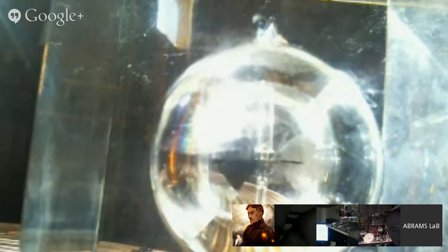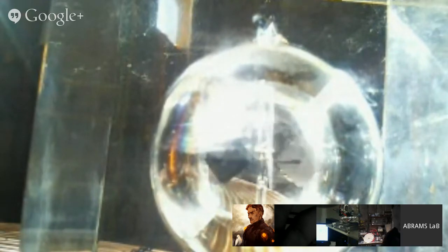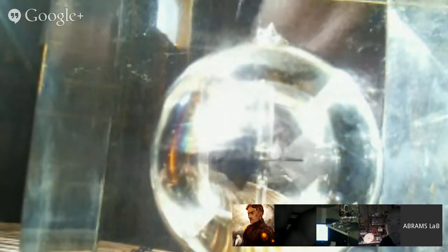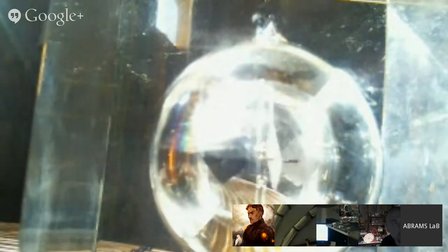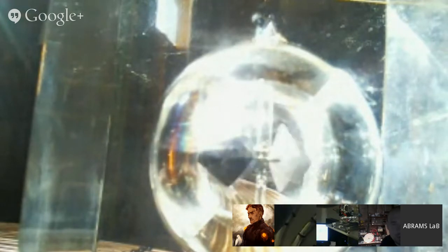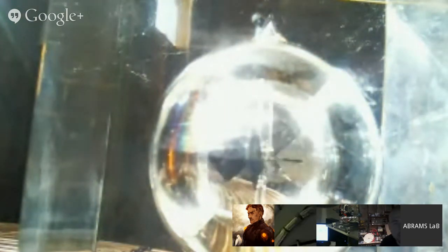Yeah, probably the best thing to use is helium, and it's not as dangerous as using hydrogen. Helium is great as far as being able to build up and collapse, and it has relatively moderate ionization properties, but it's not as conductive as hydrogen or argon. It has a higher resistance. Basically it is a resistance, until it's ionized, and then it no longer has very much resistivity at all, like most inert gases.